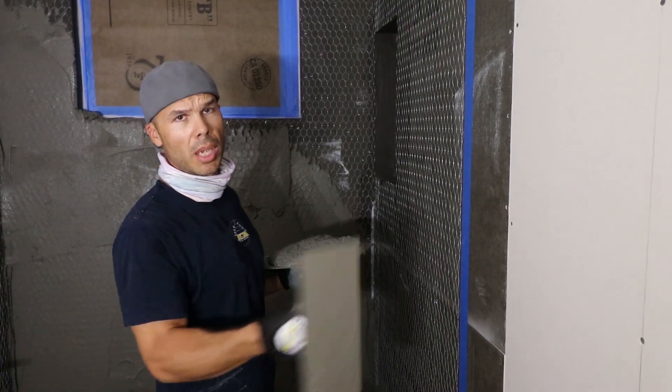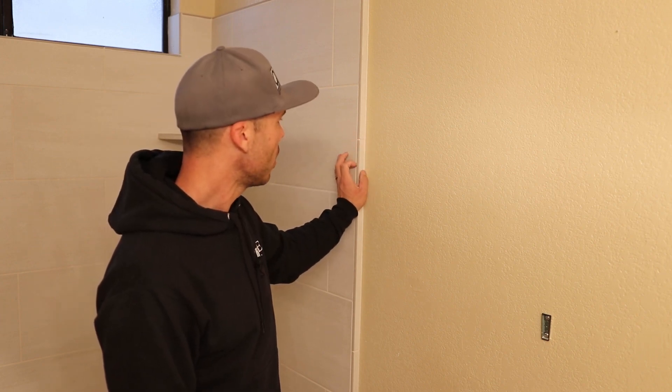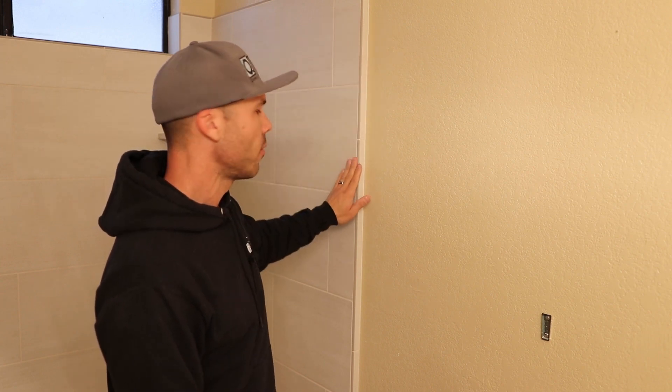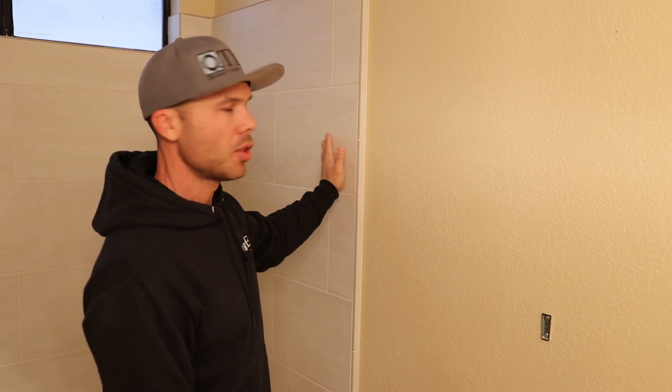The other question I get a lot is how do we trim out the edge when we float — we've got this half-inch of build-out, so how do we treat the edge? Well, in this instance there are a few different ways to do it, but we took the bullnose trim that came with the tile. This was actually a three-inch by twenty-four-inch trim piece, and we ripped it down to however thick we needed — about an inch, maybe seven-eighths or so. It varies because the drywall next to it isn't perfectly straight, so we kind of scribe in against the drywall. We call this a cap. It has the finished edge of the factory bullnose. We miter up in the corners, do the top. It creates a really nice trim piece — much better than putting the three-by-twenty-four on its side, which cuts the whole pattern up. With a cap it looks finished, gives our tile job a little substance — stronger, thicker, and a really nice way to trim it out.